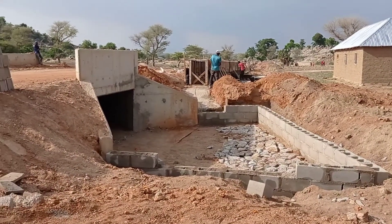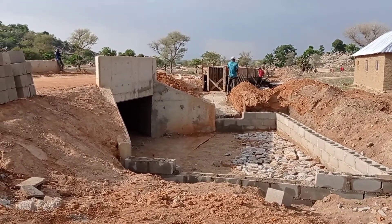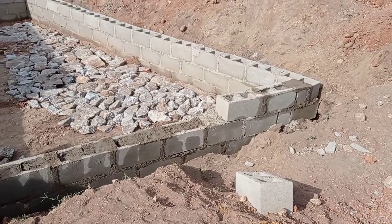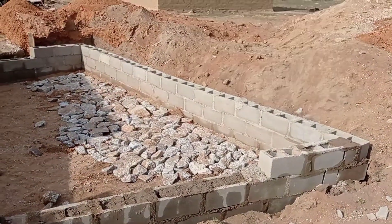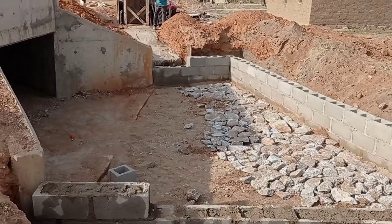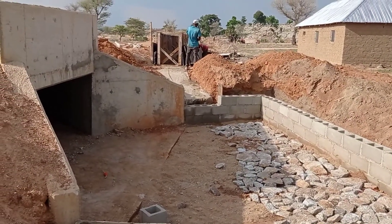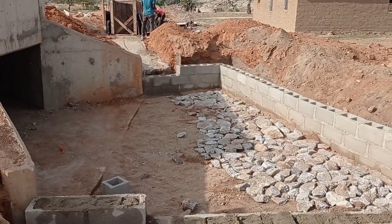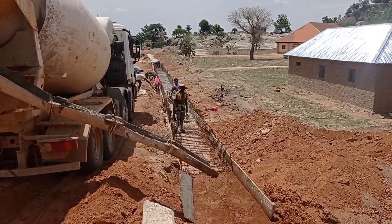You may see that this is our water collection chamber. The water is going to be entering through this chamber and then it will pass or flow out through this box culvert. In this chamber we are also going to do the stone pitching, which will be done with a thickness of 20 centimeters.